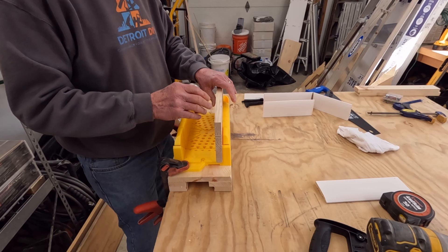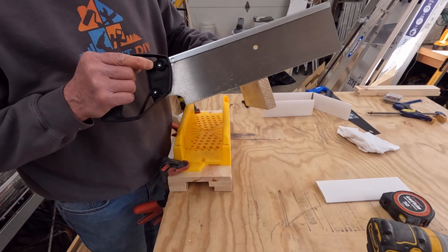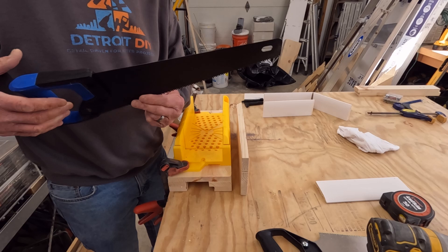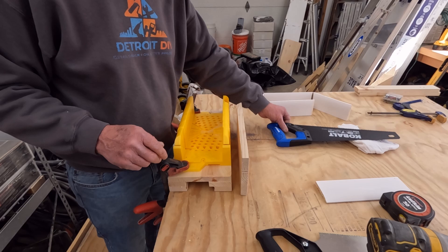The other thing I want to add is we will no longer be able to use this saw, because this saw has a ridge across the top and it just won't let you go any further than about halfway through this material before that ridge hits. So we have to use a different saw. The saw I'll be using is an 8 teeth per inch cobalt low-friction blade, and I'll be making the entire cut with it — not bringing the original saw back into play at all, because there could be a slight difference in width that would cause issues with the cut.